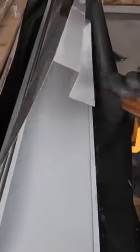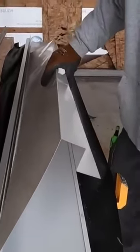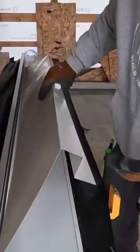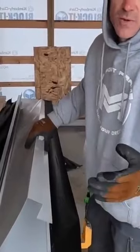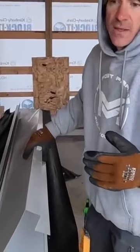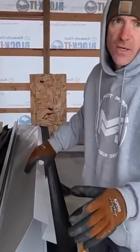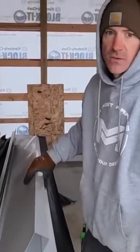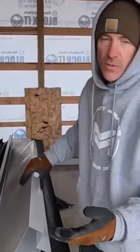The reason I like this — you'll see once I put it up — is because I can then put a J-trim right here, and it's just way easier trimming your garage door openings out if your steel doesn't work out just perfectly. You can plan when you're designing these buildings, but sometimes it just doesn't work out depending on how many garage doors you have, where maybe you have a rib that ends up landing where you don't want.